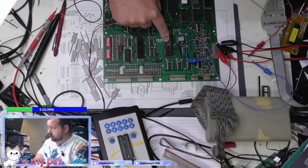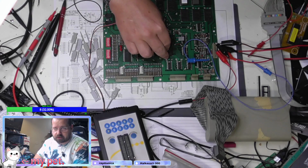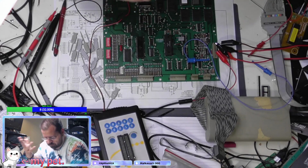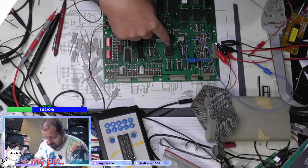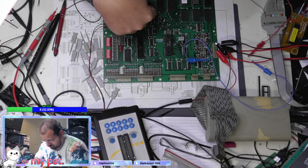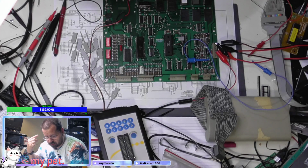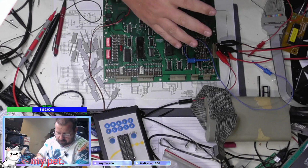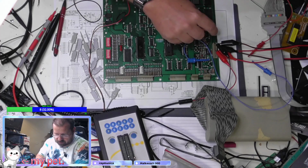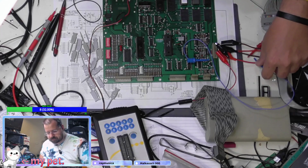We also noticed the CPU wasn't doing anything, so we actually took the CPU out, hooked up the Fluke troubleshooter, and when we did that, we could see everything, but it was also running, but it still wasn't working right. We determined the issue was something with the reset line that was tied low at the end of the video. And then off the video, I started doing a little bit more digging, and I had a bad transistor, so I replaced the transistor.